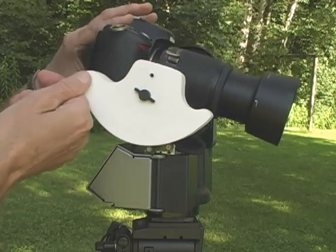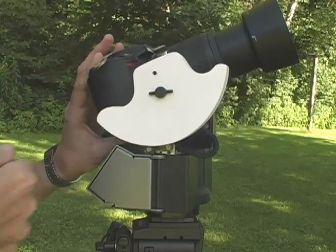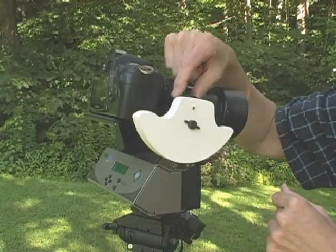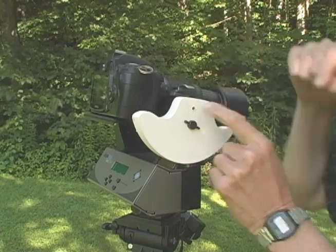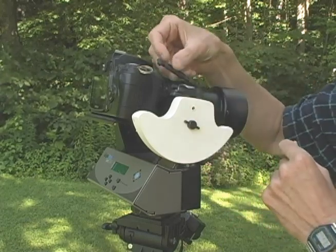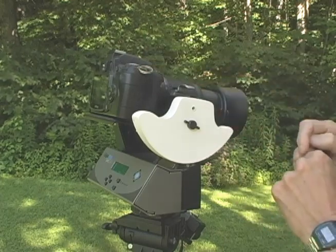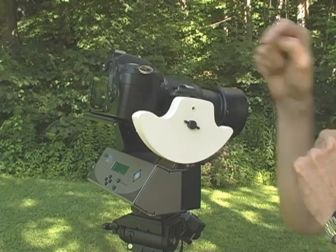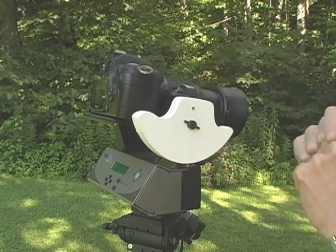The camera tray is now supported solidly as it tilts. The button pusher is now not so easily adjustable up and down. This upper hole allows me to slide the button pusher up and attach the cam in case I wanted to use the button pusher arm which came with the Epic 100. Right now it's adjusted to use another button pusher arm to push not the shutter button on the camera, but the button on a wireless remote.